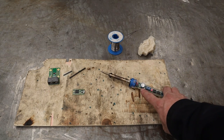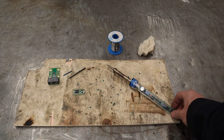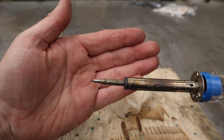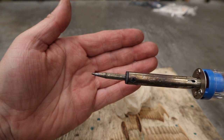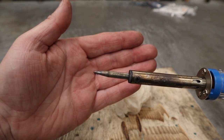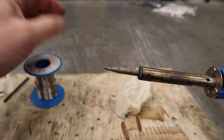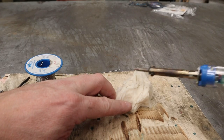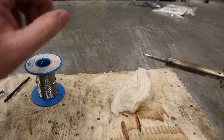I've got a nice little adjustable iron here. I'm going to set it to 375 degrees Celsius, and when you plug it in, the red light will be on. When it goes off, that tells you it has reached temperature and you're ready to go. You can see the end of the soldering tip is kind of dull and grayed out — that's oxidized solder. So when you've taken a break, you wipe it on the paper towel and it'll look nice and shiny again.